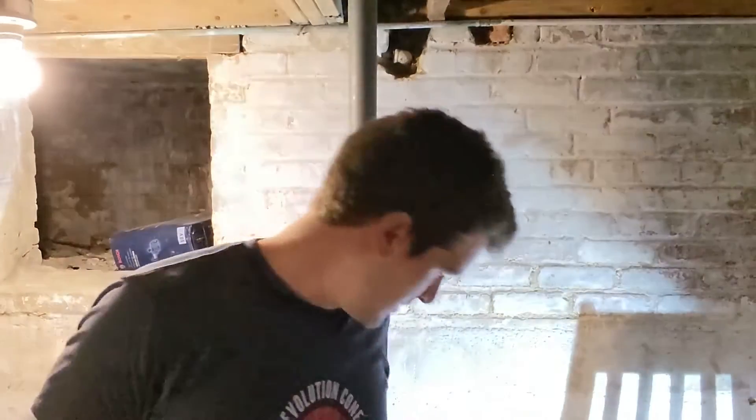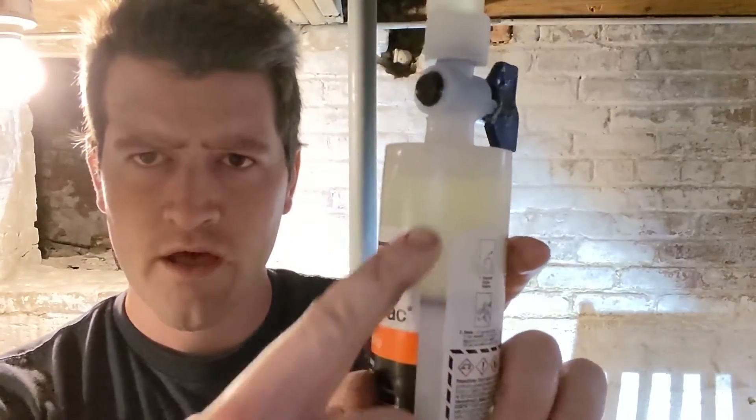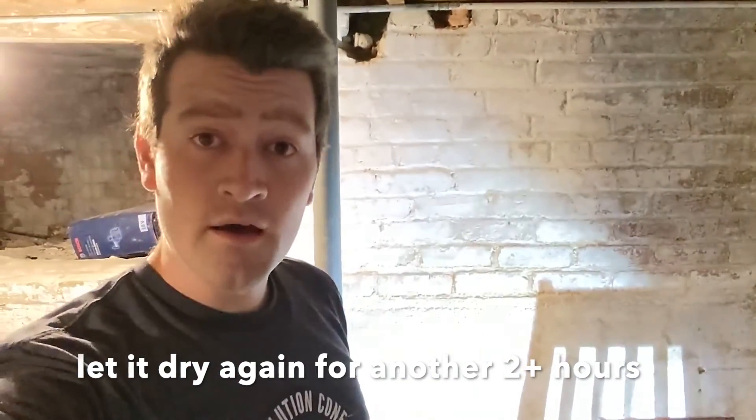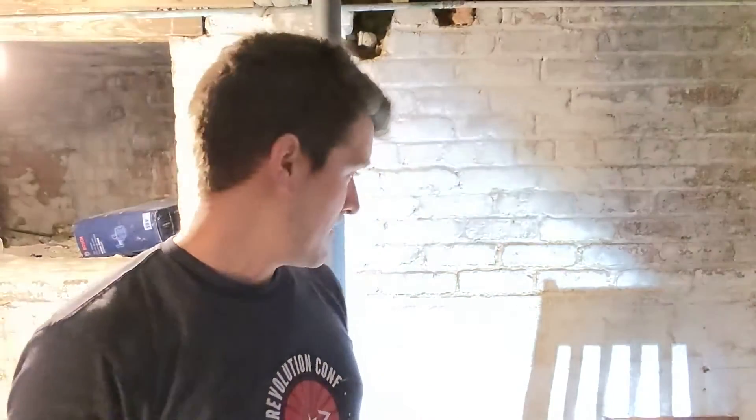Injected all of our ports. Right now the epoxy is inside the wall. Let me show you how much epoxy we ended up using — we've got about that much left, so we used quite a bit. That's all inside the wall right now, bonding to the concrete, hardening, and working its way into every little crevice to fill those gaps in the wall. All we have to do now is get rid of all that gray stuff. I'm gonna go get my angle grinder and one of my grinding discs, and we're gonna grind all that down, flatten it, smooth it, and get it ready to clean up and paint.